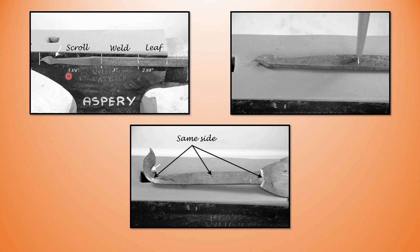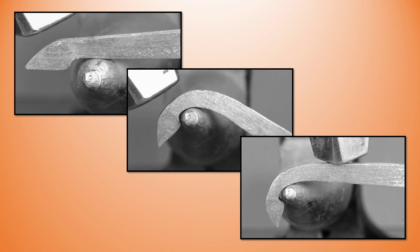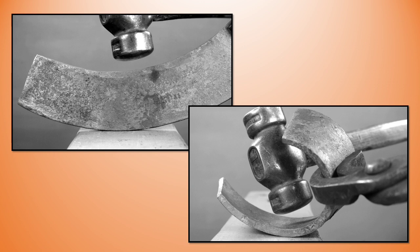You're going to want two left-facing and two right-facing beveled scrolls — they are directional. As you offer up your scroll tip to your chalk marks on the anvil, have the shoulder two up, which gives you two right-facing, and then two down, which will give you two left-facing. Chalk mark your bar, center punch on the same side as the shoulder for the leaf and the bevel on the scroll. Then bend the neck of the scroll to 90 degrees — keep this bend short. Half an inch in diameter is what I'm looking for, and then start the blowback for the leaf.